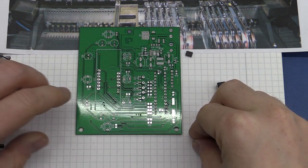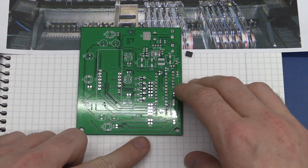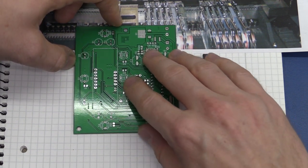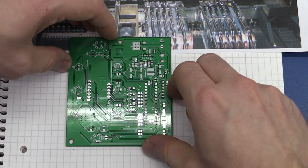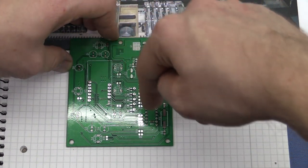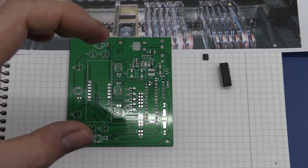So back to the machine here. We now have a camera to check the alignment of the components, but there might also be variations in the boards themselves. So you can make a mechanical stop on two sides and you can put your board against that, and you can do that repeatedly. But if the board itself is not cut straight, then it will be in a different position. And until now, we have no way to take that into account. We could do it manually. Each time we put in a new board, we can bring over the tool with a component and just check the alignment. But that is not going to be fast, and we would like to at least semi-automate this.